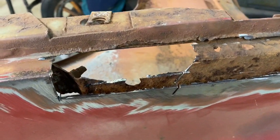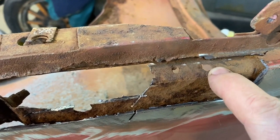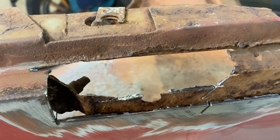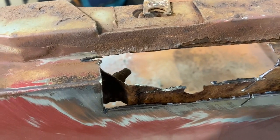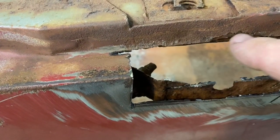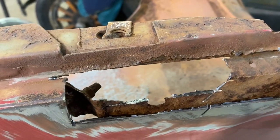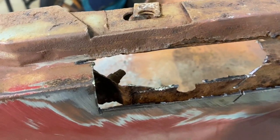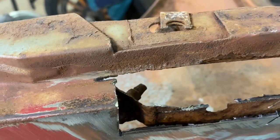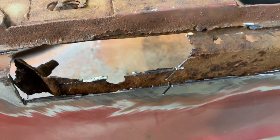Okay, so we've got our pieces cut out. There's a little bit of a pit hole right here, and I think I'm just going to fill weld that. It's so small, and it'll be fine. So, again, in here, I'm just not sure yet where I'm going with this, so I've got to ponder that a little bit. I'll make this piece extra long. I'm thinking the best choice probably would be to just blend this in with weld and grind it down and make it look fine. So that's probably what I'll do, but I just need to start fabricating and see what we end up with.